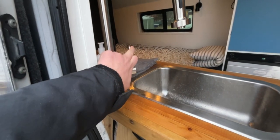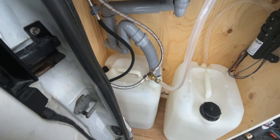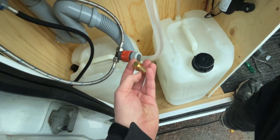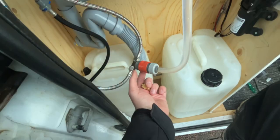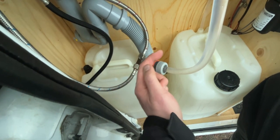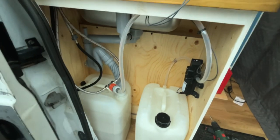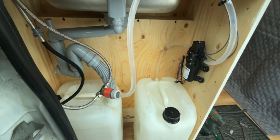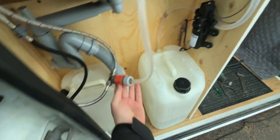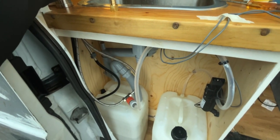So let's see what happens if I close this — I had it open just to test it. If I close it, what will happen? Three, two, one. Crap — so this ended up not working. The clamp was not strong enough to hold it in place; it spurted water out on the side and the pump would not stop. I ended up taking an adapter from my father's gardening hose, put it on with plumber's tape on all the threads, and it did actually work. No leaks. Works perfectly fine. No leaks here. Now when I turn this on, the pump turns on, and when I turn it off, the pump turns off.